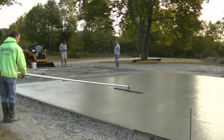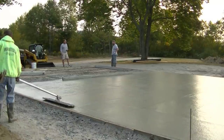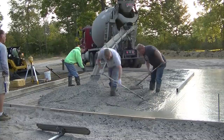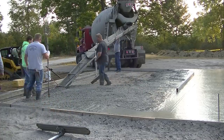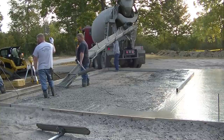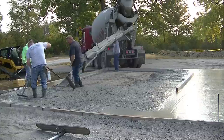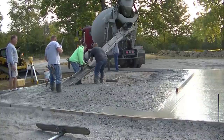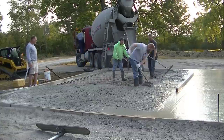There was a little bit of lag time between the second and third truck. The plant we're using has about ten concrete trucks, and they're loading concrete for a bunch of other people too. You can see the third truck showed up. I'm tugging up on the rebar around that outside edge as we pour, getting concrete underneath all the wire. Once the aggregate gets underneath that stuff, it doesn't go back down to the bottom even if we step on it — the aggregate holds it up.